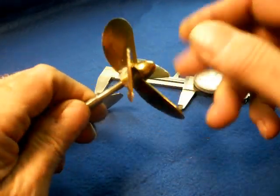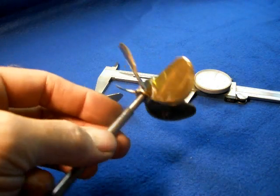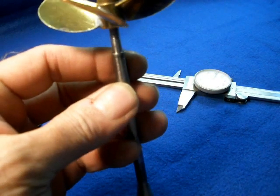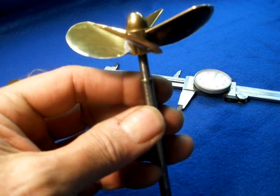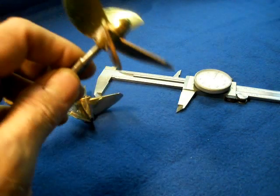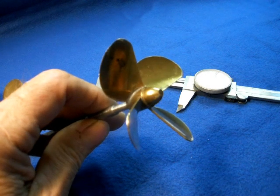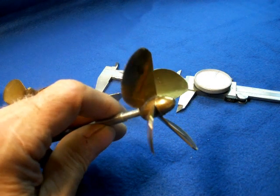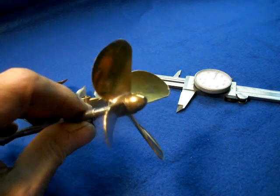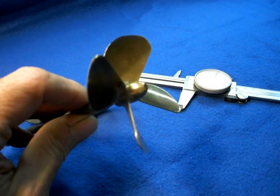This is the last prop I tested. This is another one of unknown pitch. I sharpened the back of it, but when I pulled it out of the drawer, the blades are just stamped pieces of brass that were soldered into the hub. It actually performed pretty well — I do have this one on video. At 60 psi it turned 2,180 rpm, but similar to that Kohl's cast prop, I'm not convinced it's a particularly efficient design.